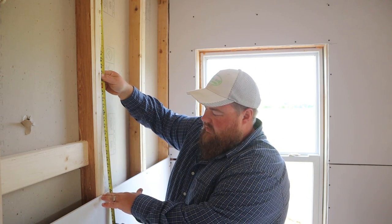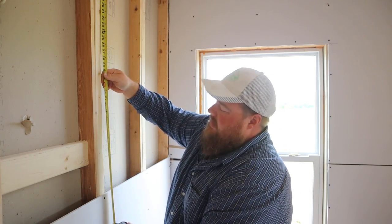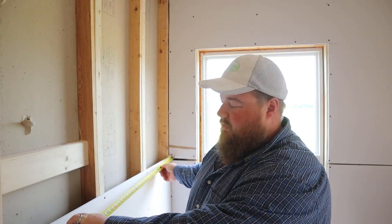So I got my tape measure here and I'm going to hold it up against the ceiling and look at 48 inches, which is the width of the drywall. I'm going to move it left and right, so it'll raise up and down, until 48 inches is even with the top of the drywall I already have put in place. With that position found, I'm now going to measure from this mark to the wall: 29 3/4.